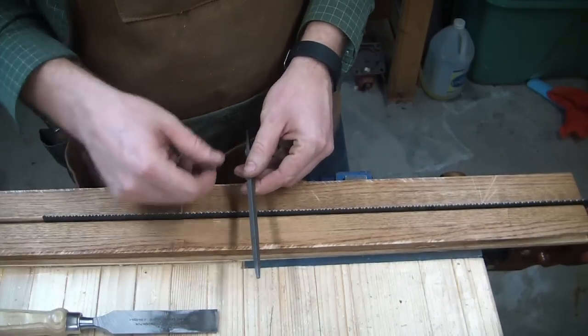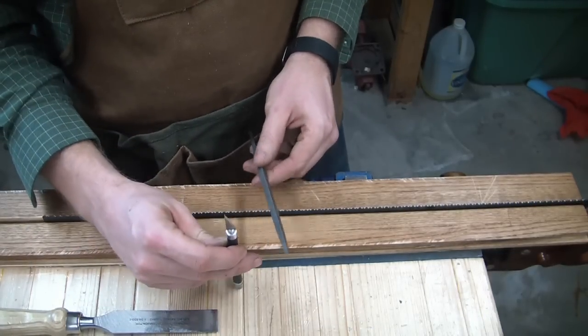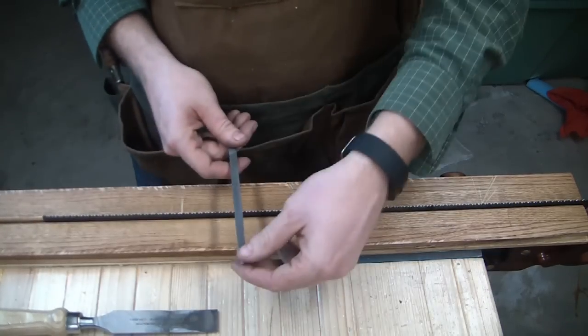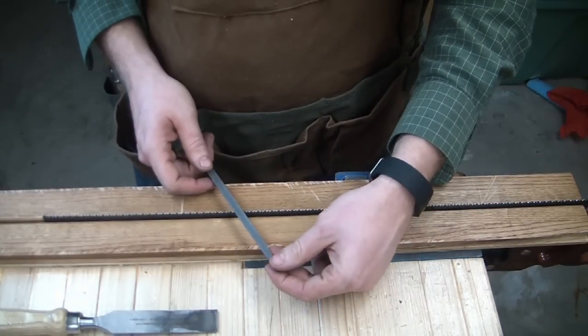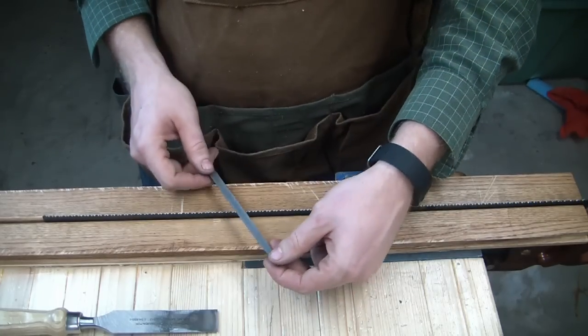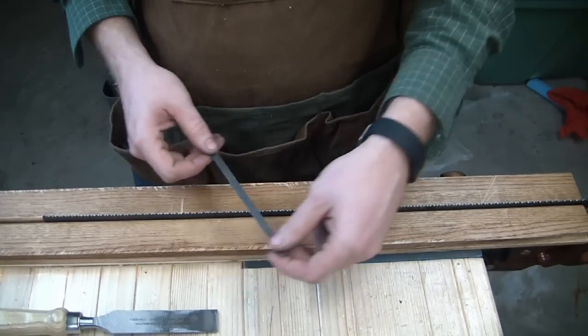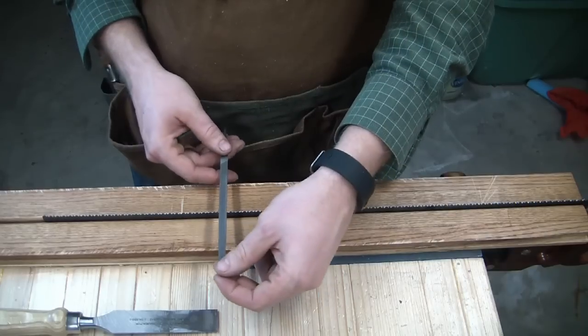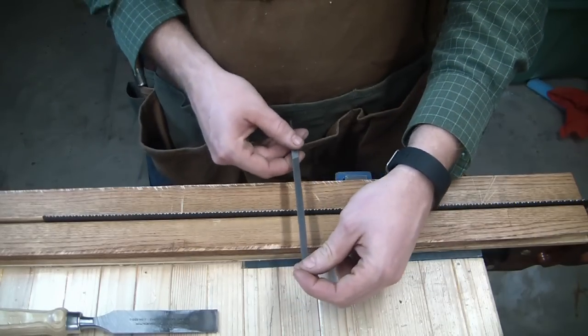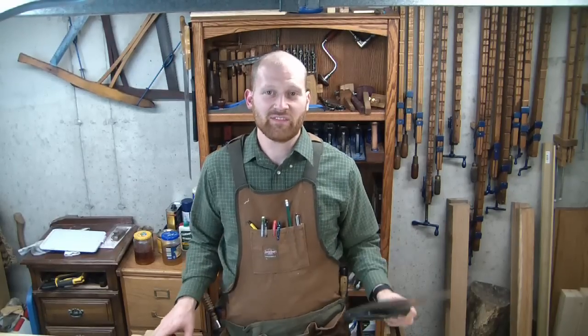Whereas with a cross-cut, you want to create a knife. There's a knife blade, so you have to turn it to match the angle of the knife blade. With a cross-cut, you have it turned at an angle, so every other tooth is at an opposite angle, so that you create a knife blade on either side. And with the rip saw, you rotate it slightly and keep it at 90 degrees — every single tooth is the exact same as it goes across. There you have it. That's the difference between a rip saw and a cross-cut saw.